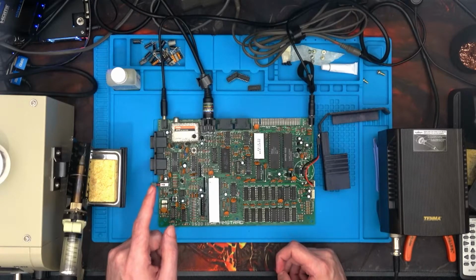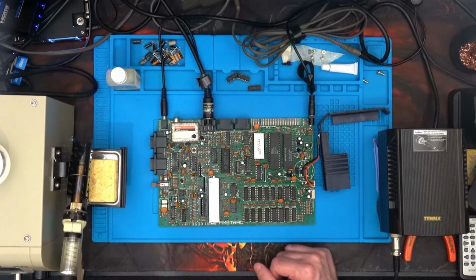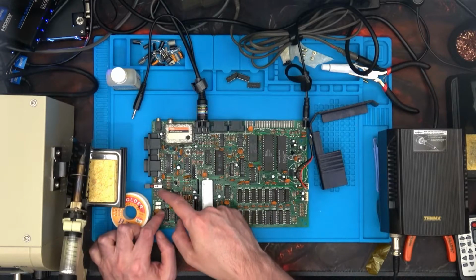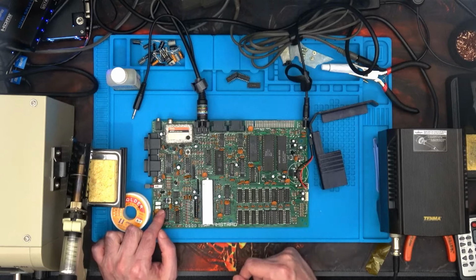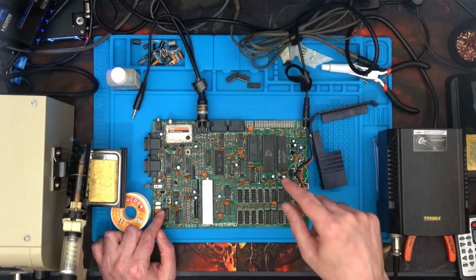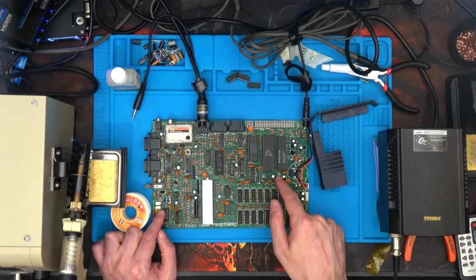The next bit we need to get onto is flipping the transistors. So I'm going to do that. Okay, as I've already mentioned, TR4, TR5 and TR8 all need to be swapped around. So you need to desolder. Don't just do the outer legs and spin it. Do all 3 legs, desolder it, put it back. Also test them if you can. You might have to get new ones.